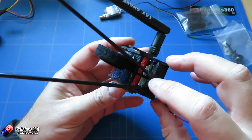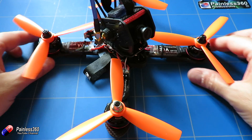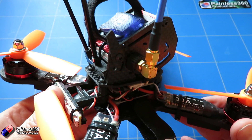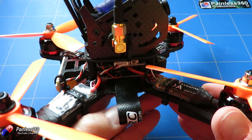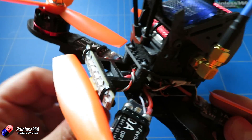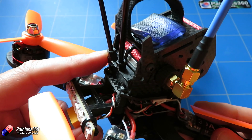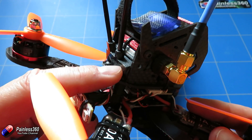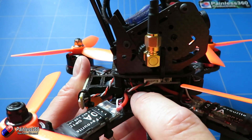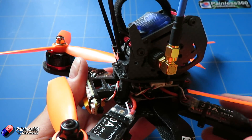Now we've done that, we're almost ready to put it together for the final piece — and we have finished. Here it is all installed. The top deck connects to the pillars with four screws — two at the back and two at the front. Because everything is so busy up here and I wanted everything internal in this vertical mount, I had to file a little bit out of the 3D-printed piece. You can see the 12-volt and ground wires in there — that is what is powering all of the FPV equipment. I put a little 90-degree connector on here as well for the antenna.